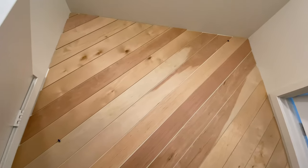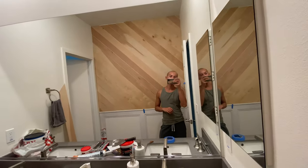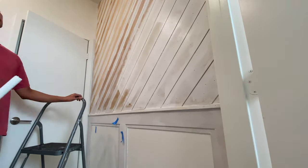This is what it looks like once all the pieces are nailed in. The surround edges are not perfect, but that's okay — I'm going to put a trim piece along the corners to give it a finished look later on. I would recommend priming all planks first before cutting and nailing them onto the wall, because trying to get primer in the cracks is not fun.